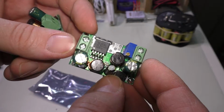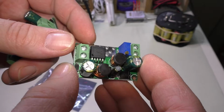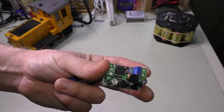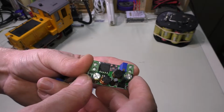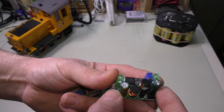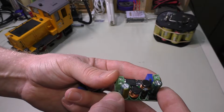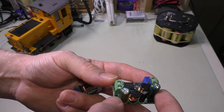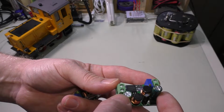I'll put the specs and the link to see this down below, but I can really quickly tell you some of them. Now, this has an input range of 5 to 32 volts and an output range of 1.25 to 45 volts. And it says a maximum switching current of 4 amps. And anything else you need to know, you'll just check out the link below.